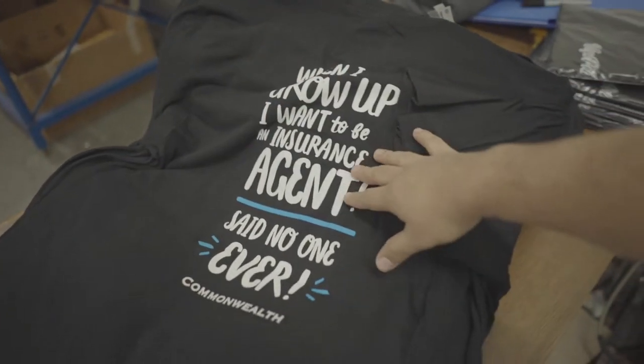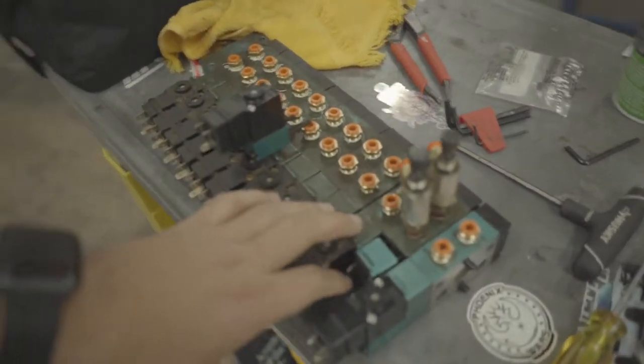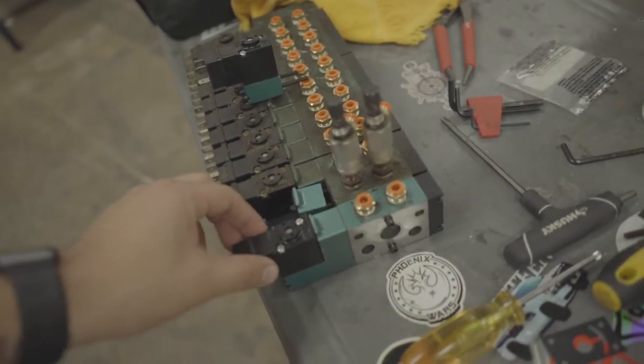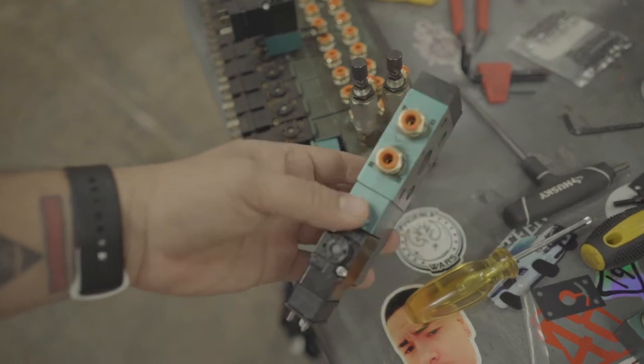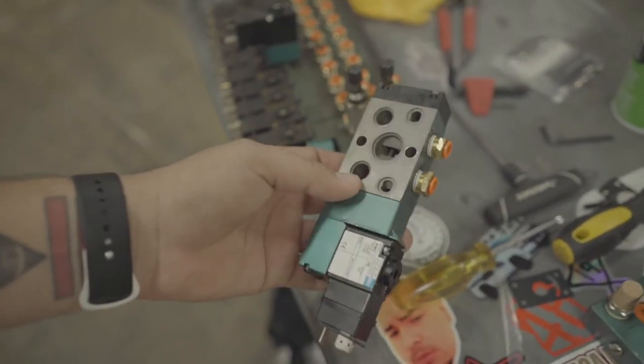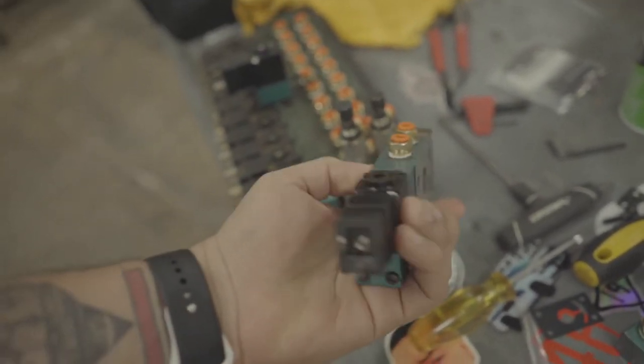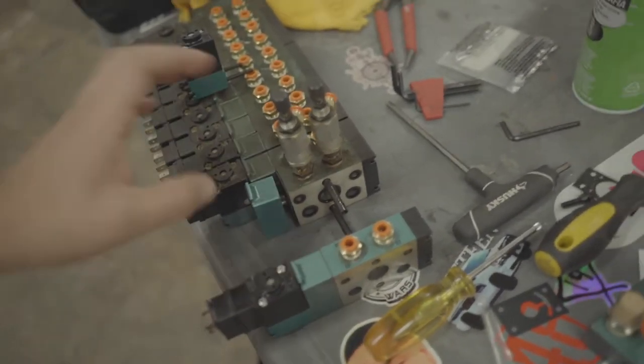Yesterday me and my wife came in on a Saturday night around five o'clock and we ended up printing the backs of an order on the automatic for the Commonwealth Insurance job. Afterwards, since the machine was warm and everything was working well, I decided to go ahead and take the entire MAC valves from underneath the press — these are the ones that control the chop cylinders on each head. I took about 45 minutes to rebuild one of them, being cautious with all the gaskets going in the right place and making sure everything was nice and clean.